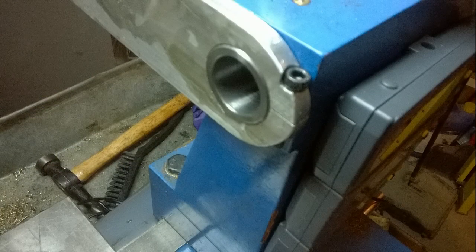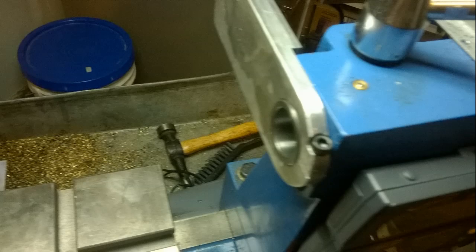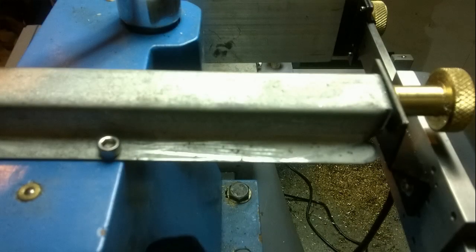I used a piece of half-inch thick aluminum bar to make this mount for the tailstock DRO. It clamps to the quill and extends backwards to clear a casting that's in the tailstock itself. Here you can see from the top how it mounts to the end of that quill clamping mount bar and also how it mounts to the reader head bracket that's mounted to the top of the tailstock. Here's the bracket I fabricated for the reader head attachment point that goes across to the top of the tailstock.